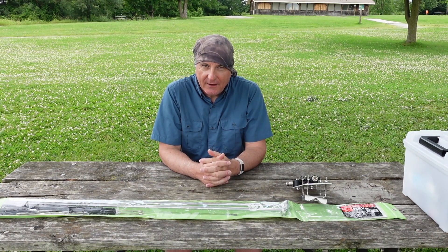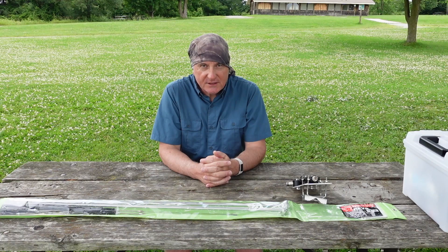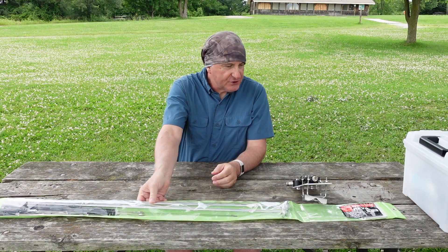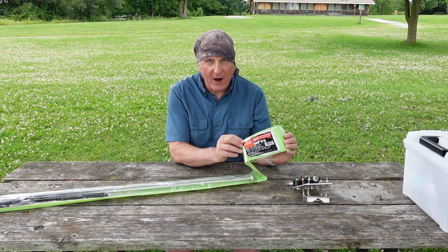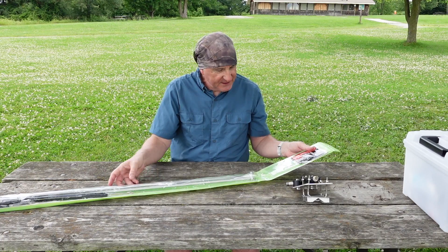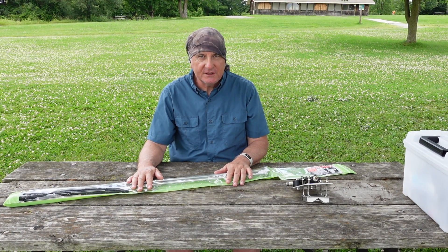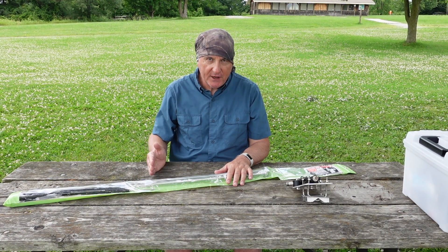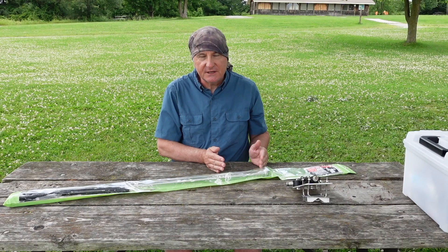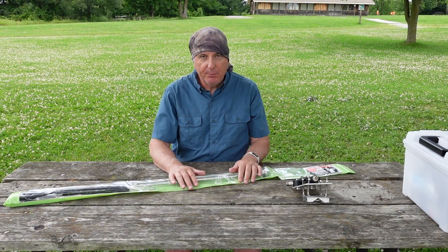Having said that, I'm also a fan of unusual antennas. And that's the subject of today's video — one of these. The one in question is the Diamond HFV5. What this antenna essentially is, is a shortened dipole that covers 40 meters, 20 meters, 15 meters, 10 meters, even 6 meters. It's not designed for operation on the other bands. It's a shortened dipole.